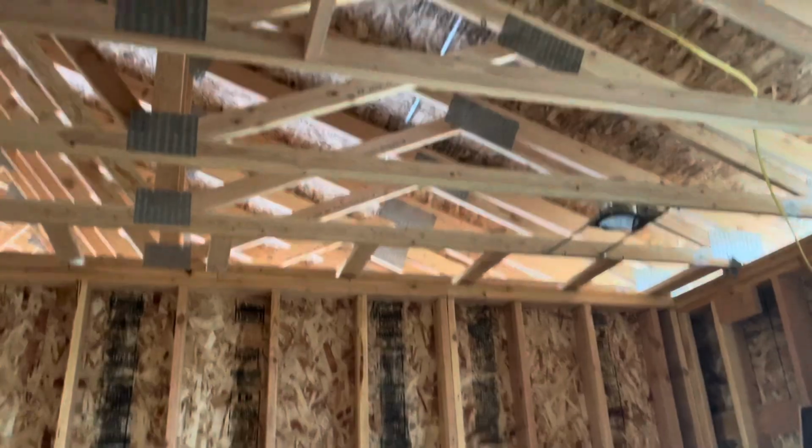That's what our builder used in our house over here. And man, we didn't have any wobble in any fan in the house, and it was really nice. So I texted him, I said, hey, what bracing system did you use? And he goes, just on a joist or a crossbar, mount the saddle box. There's no wiggle to any of the fans in our house, and we had different size fans in different rooms, and a couple of them were pretty big units. This will support up to 70 pounds, so it's pretty slick.